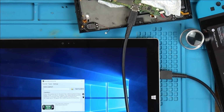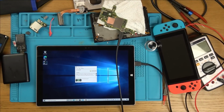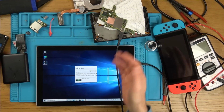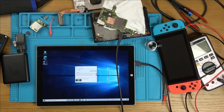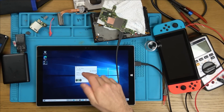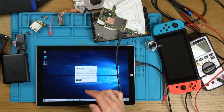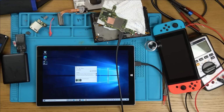RCM okay. So I think what's happened is, the person I'm speaking to is probably the dad, and I think one of his kids, if he has kids, has done this without the parents knowing, which, you've got to admire that in a way, haven't you? Because it's something that's quite technical. So yeah, it's a hacked Switch. Now, I'm going to try and get it back to normal by downloading a payload. I've got to inject it into here, and then I'm going to try to disable auto RCM so it can just be used as a normal Switch.